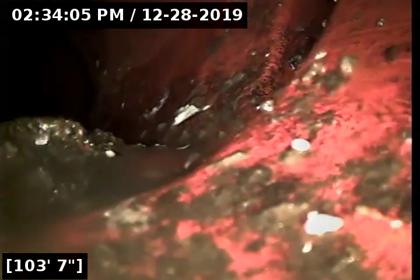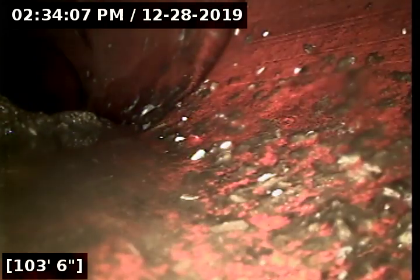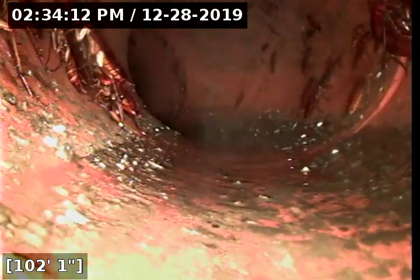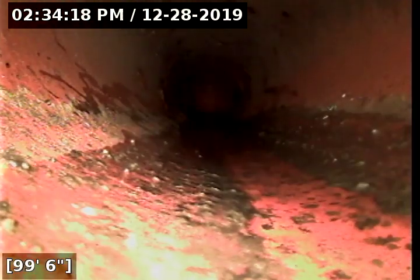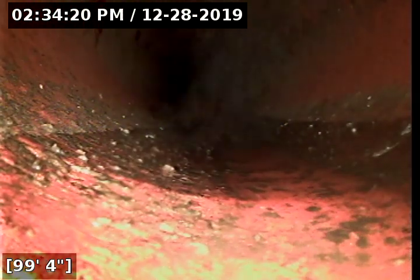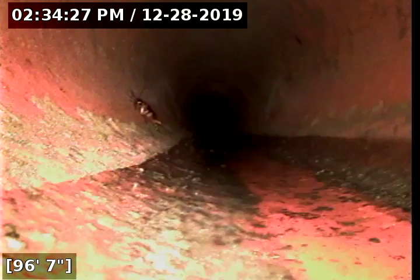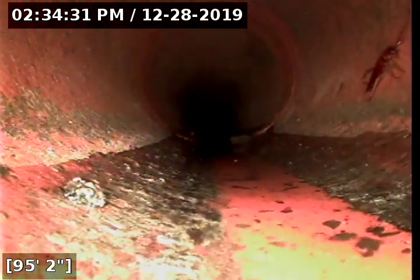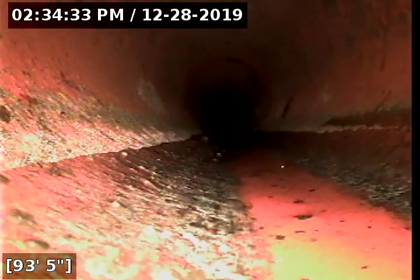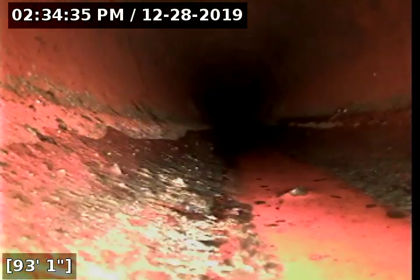And then working my way back from the saddle. So typically, the homeowner is responsible for the saddle and any portion prior to that. We're seeing a lot of water bugs in the line. So the distance indicators on the bottom left-hand side of the screen, about 98 feet remaining. I am working my way back from the city sewer connection. So that's actually in the middle of the street on Itasca Street, once again.